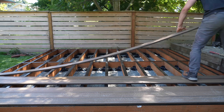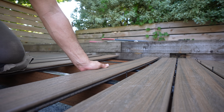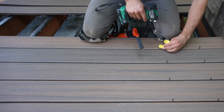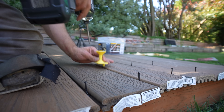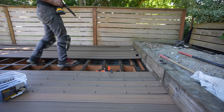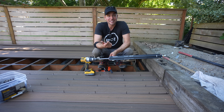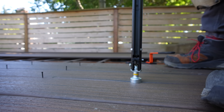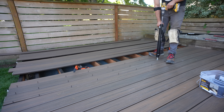I position the majority of my remaining deck boards so I'm ready to start installing quickly and efficiently. One of the main reasons this system is so fast is the never-miss guide system — you place the guide right over your fastener, and the drill bit that comes with the kit is the perfect extension length so you tighten it down properly without over- or under-tightening. The camo drive system makes it even faster because you can literally stand while screwing the fasteners into place, versus being on your knees the entire time.